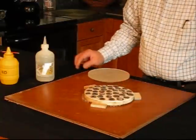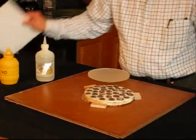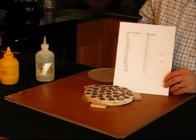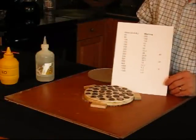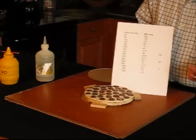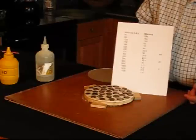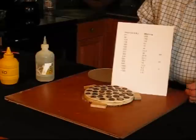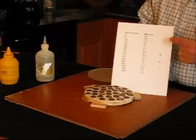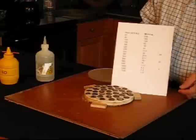For fine grinding, we need grit. Grit comes in either mesh sizes or in micron sizes. The grit I use is aluminum oxide from Universal Photonics. Depending on how coarse you generated your part with will determine what grade of grit you'll need to start with.